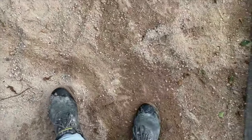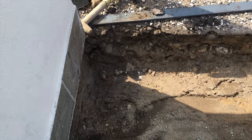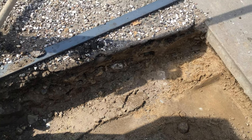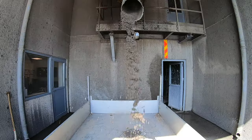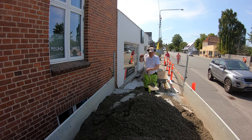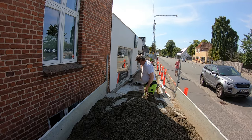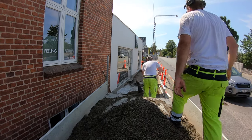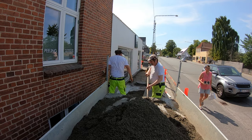On the end where the edge line is, I dig a little deeper hole for better support, just in case some big car would drive over, and it acts just like a submerged curb when the concrete is poured. The strength of the top asphalt layer is just as good as the underlay. So the better the soil is prepared, the longer the life cycle of the asphalt. In our case, the soil is sea sand — very good since it is easy to compact and it has very good drainage, which is an important aspect.